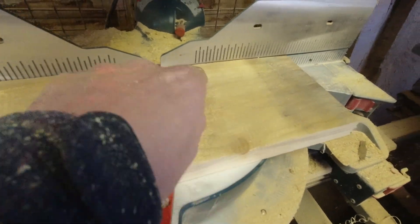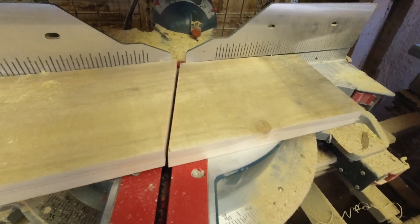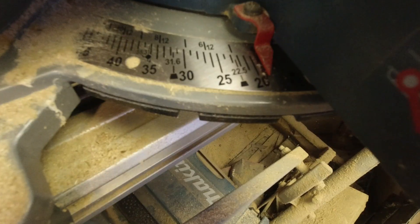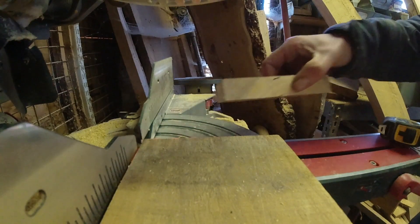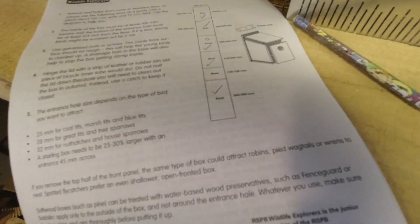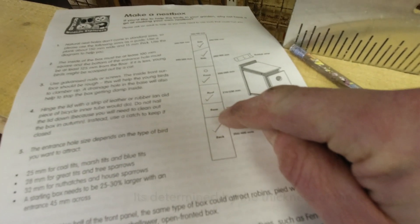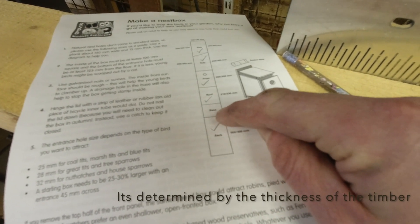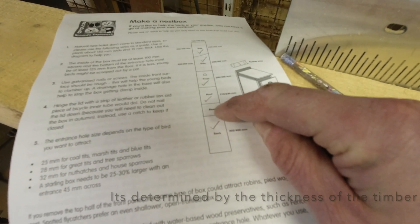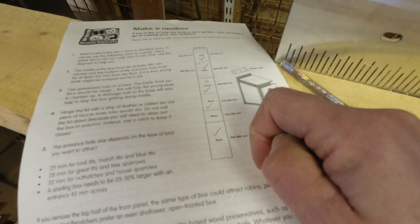When you're cutting the sides it's got that at 200 mil, this side at 250 mil. I don't know what the angle was so I've just invented my own — between 18 and a half and 19 degrees. I've got all the cutting list done now. The only one I've not done is the base, because I've done these before and my sizes are very slightly different, so the base hasn't fitted. I'm going to assemble the whole lot, get the exact size of the base, and then cut those.